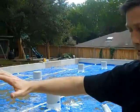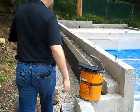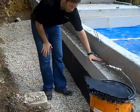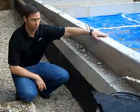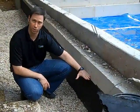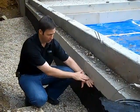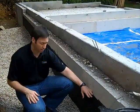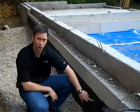On this left hand side we've got a little bit of a grade change, and I wanted to show you what we did to waterproof this. You can see the final grade for the house. This is the stone ledge on this house, so we'll have stone down to here. Our wall framing is going to sit here and the final grade will be just a few inches below that. We always want to see a little bit of space between the bottom of our stone and where the soil goes, just to see any paths the termites might be creating and make sure the house isn't getting termite infestations behind the walls.